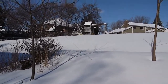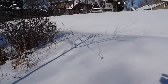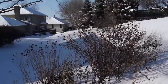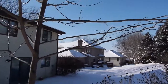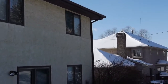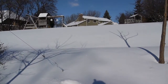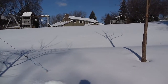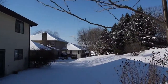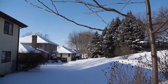What you'll see here is the far end of the PAR antenna. I'll zoom in on it here as I come up. I have it as a sloper going up through this tree and then up to the house — actually going up to the room there. I am facing due north, so my antenna is oriented going from southwest to northeast.